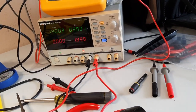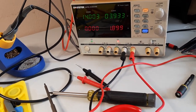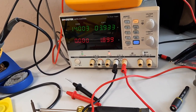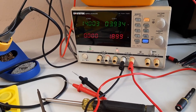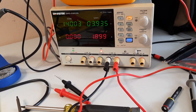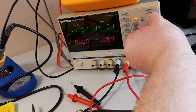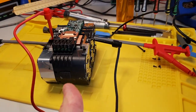In terms of amperage, I'm charging three in parallel. I currently have my current limiter set at 1.9 amps — I'm just being really conservative with it. This power supply will go up to 3 amps on one set of cells. But I got to thinking, if individual cells are charging at different rates, I'll just set it at 1.9. That'll keep it under the rated constant current of 2 amps for individual cells, for sure. I have this set at 4.2 volts, and right now it's current limited because it's taking the max current I've set.